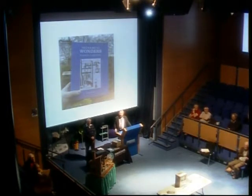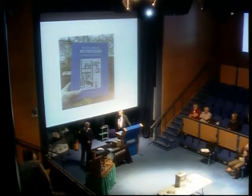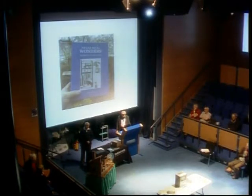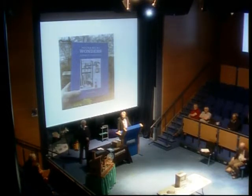Sorry, did he have a pump to recharge the boiler? Yes, he did. At the end, I'll run the engine for you, and it has got a water feed pump. It will be the first high pressure water feed pump on any engine, and it is driven from the crankshaft with an eccentric. The eccentrics, you can see that clearly on the engine.